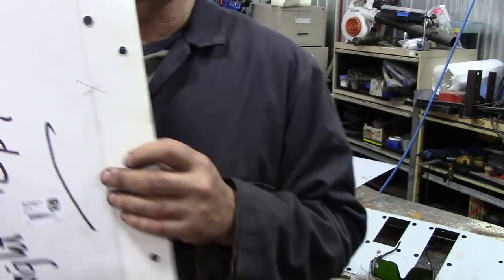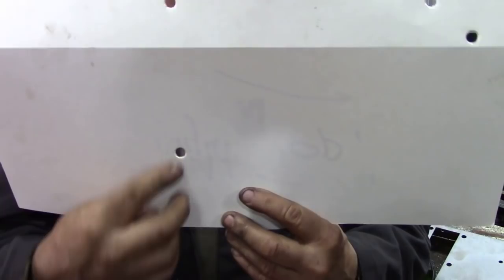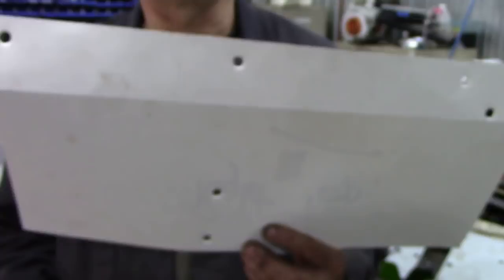Now, this is the exact same size as the footwell, and you notice, because it's paper, I've got the holes in here for where the support is, and also here where the little square holes are. Now, my punch is, I don't know what size it is, but it's big enough so I can just get a little square file and file those bits of metal nice and square to put those little plastic inserts back in, so that's not too bad. Might even use a Dremel, you never know, depends how the weather is.